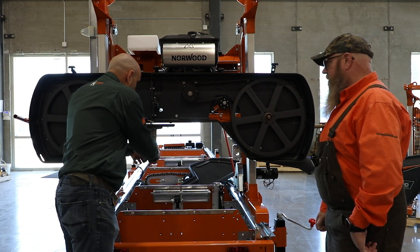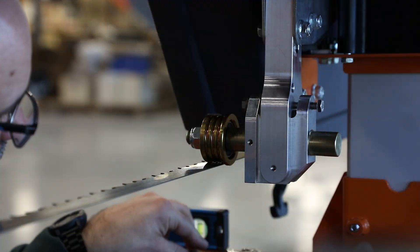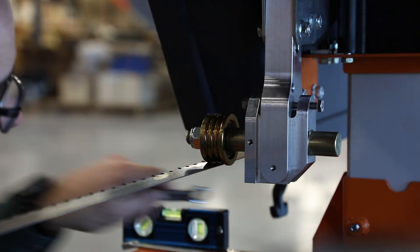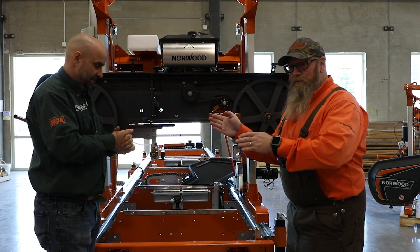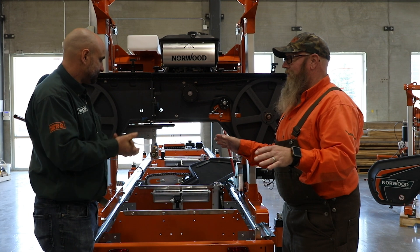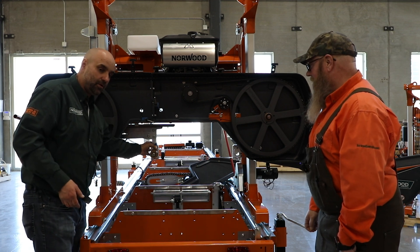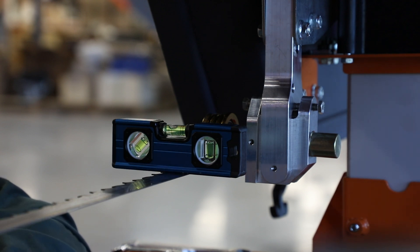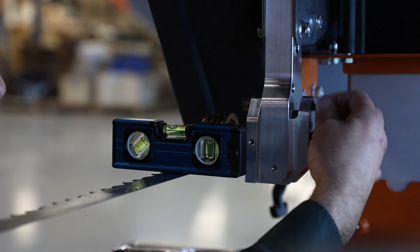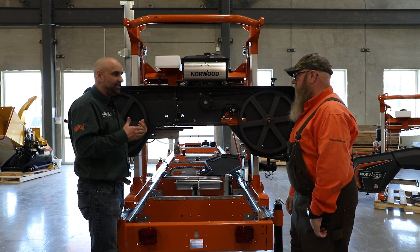With the 4-axis trunnion guides installed, you're going to put the torpedo level on one of the straight teeth — and that's a key point: straight tooth, because if you're on one of the wrong ones that turn right or left, it'll give you a false read and could really mess up what you're trying to do. You're pushing the blade down and then making adjustments — either tipping it up or down — using a front and back bolt, which tips that shaft either up or down. Then you make your adjustments until you get that bubble perfectly centered, just like you did on the track. That is the proper way of setting up your blade lead to make it cut to perfection.